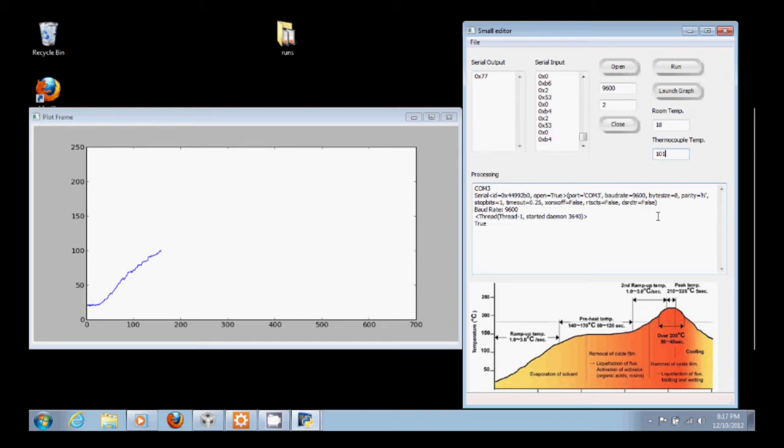And so you can't really see the coils heating up at this temperature because it's still a little cool, but once we get up towards 200, you can see them really glowing. I'll make sure to point that out. And you can probably hear the toaster kind of expanding as the metal heats up so fast. So the ramp rate's slow just to allow the parts to heat up and not induce a real big thermal shock to any of the components. And so this is the most time-consuming part, is letting this heat up.